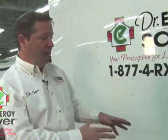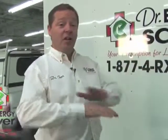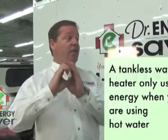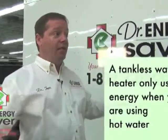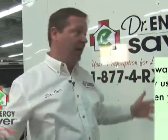So let's make sure we get this. When you're sleeping at night, when you're away at work, when you go on vacation and you're not using water whatsoever, a tankless style water heater will use zero energy. There'll be no maintenance of water temperature, no standby losses, and no water heating at all going on.